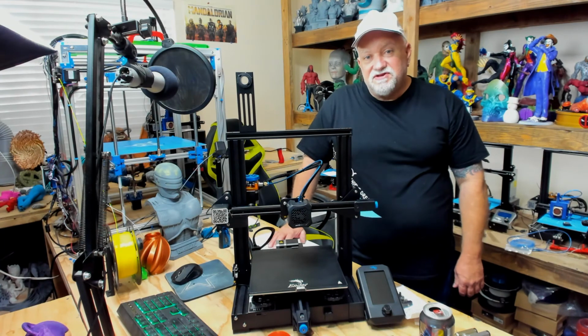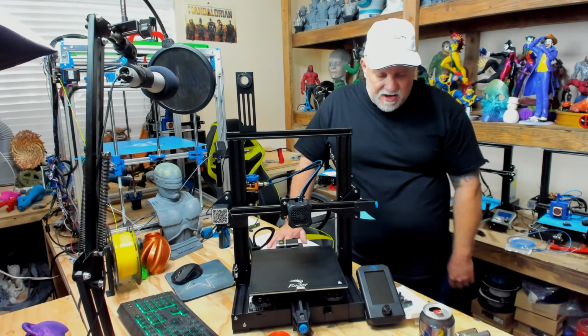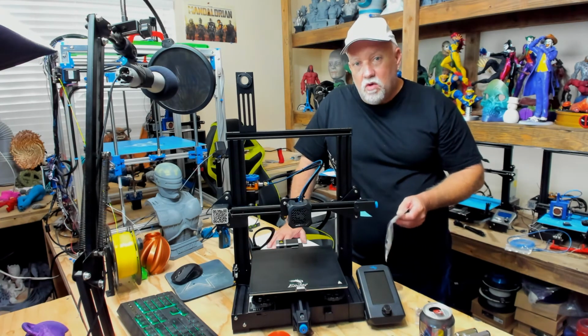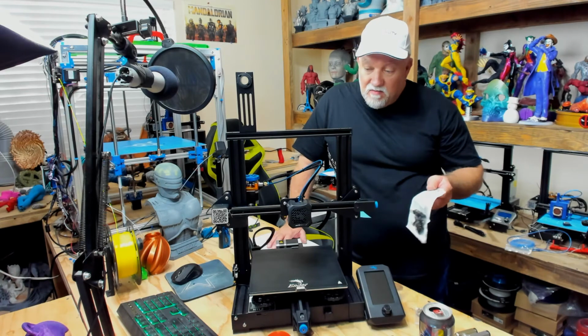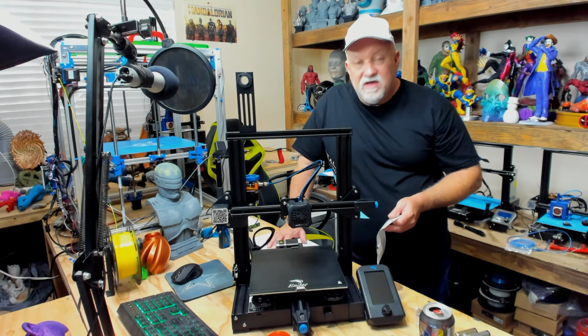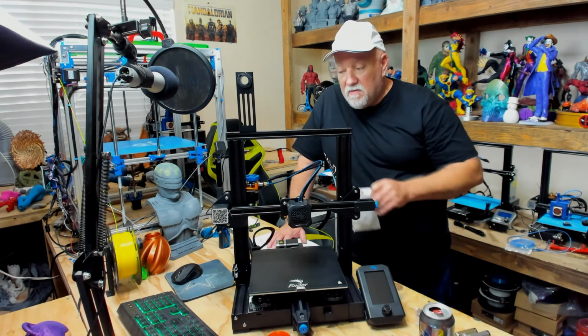And that's it. It's just that easy to replace your extruder from McEwen 3D. Like I say, it's a Flexi Plus, the one I used, and I bought an all steel gear to go with the kit. Works great. I love them. That's why I have them on all my other Creality machines. And like I say, in printing flexibles, there's no problem with that extruder. I've had no issues with it whatsoever on a Bowden setup.